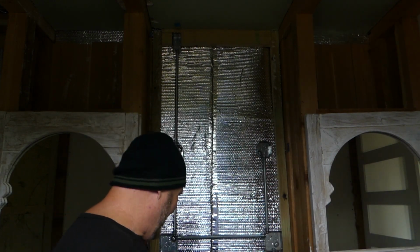And I'm in a bathroom: stainless steel, mold resistant. I'm just doing everything right. With the exception, I should have put marine board up here, but I am not driving an hour and a half to maybe not even find marine plywood. But anyway, the mold resistant, and then these are treated. Did you see these 2x4s are all treated? So let me get this up there.